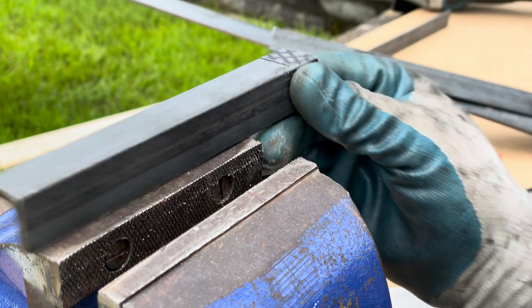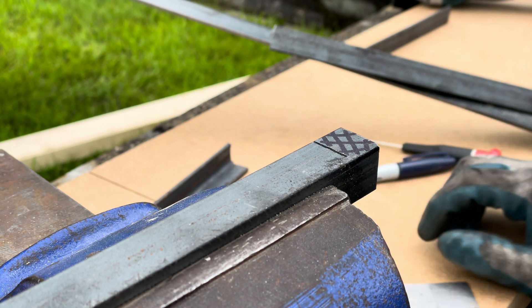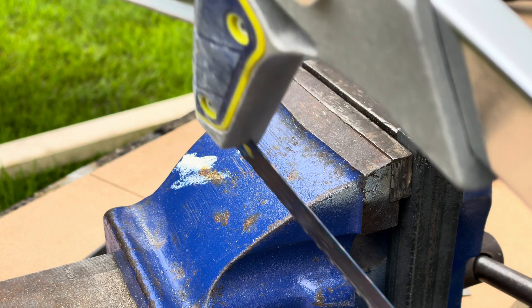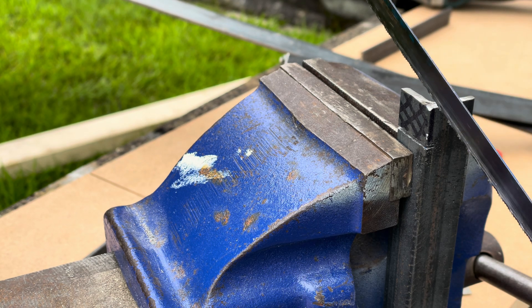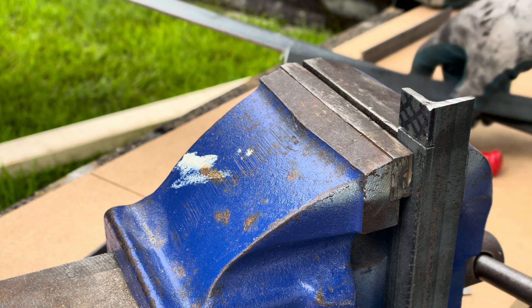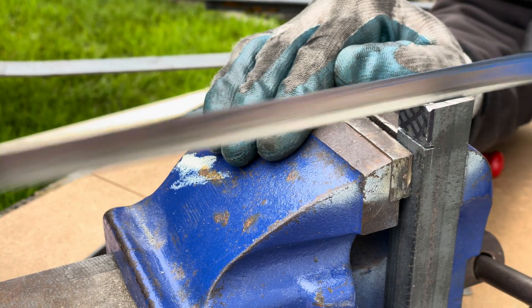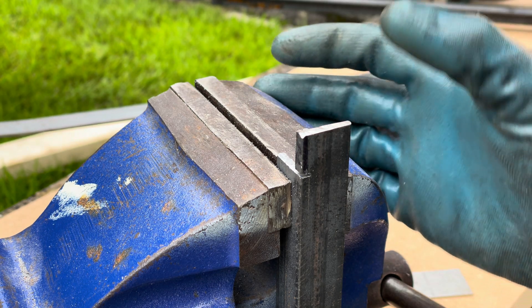Let's take that out and put it in this way, then cut down to the line — 4 mil down. I've got to cut through here. It might make sense: if I cut on this side of the line then I'm cutting more away than I need to, but if I cut on the left side of the line then I'm cutting through all of that and that will take ages. So what I'll do is cut here first, which means I've got a whole lot less material to remove on this cut.